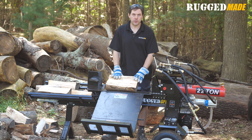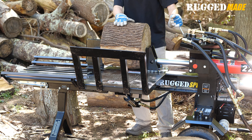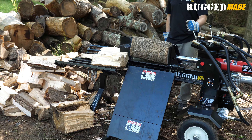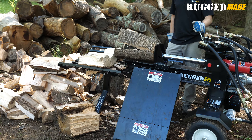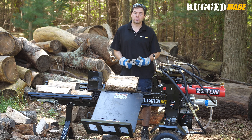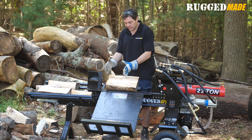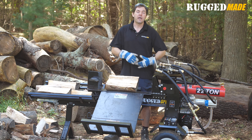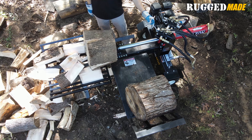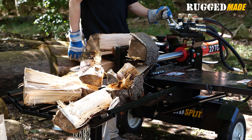Now let's look at some of the elements that really set the 300 Series apart. First and foremost, it's a horizontal splitter, also called a fixed blade or a push-through. The blade is welded to the beam, the end of the rod has a push plate, and it's going to push all the logs past the blade. You get a lot more productivity this way compared to a horizontal-vertical or tip-up log splitter, where in between every split you've got to take the finished pieces out of the way and then put the next log in place. Whereas with this, each log pushes the next one past the blade, onto the catcher tray, and then into a pile, onto a cart, onto a conveyor belt — whatever you want.